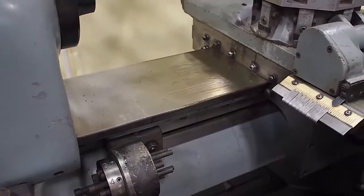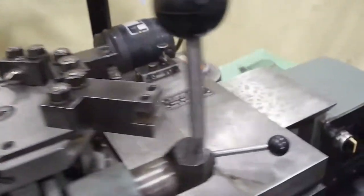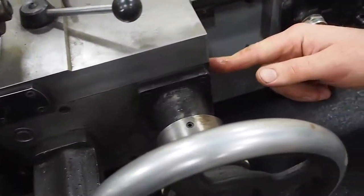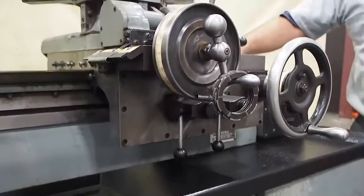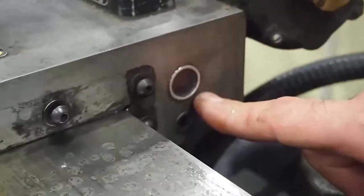Let's give it a couple pumps up. As you can see, it stays up and it will slowly go down. So this is your fill right here for your lube system, and this is your fill right here for the apron on the side. There is a sight glass here that shows you your level for your apron. And there is a sight glass here on the side, which is full right now — that's why it looks dark — and that is for your lube system.